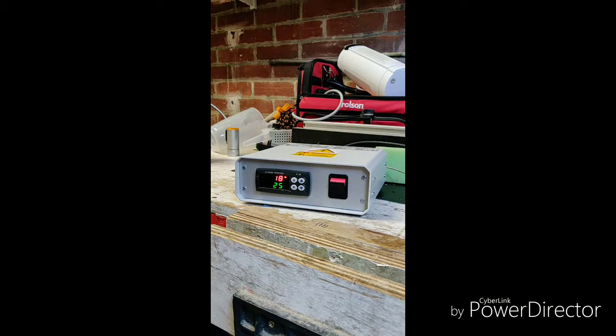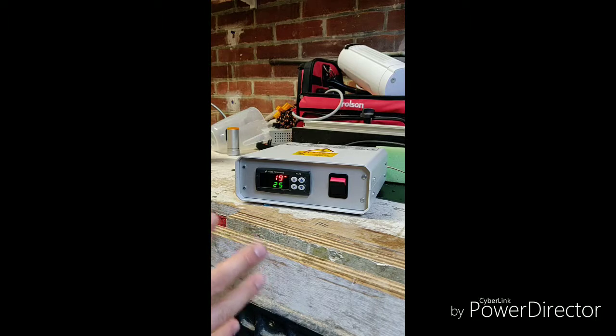The element is still on, so there may be some other parameters that need to be changed. It's possible it's doing both heating and cooling. I'm making this up as I go along, so I need to check the manual and check the configurations. Now I've got the passcode, so hopefully I've shown you how to change from the K-type thermocouple, which is the default, to the PT100 option. I'll be back in a sec.